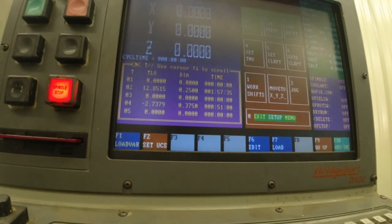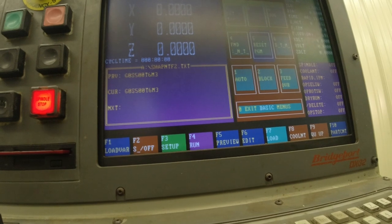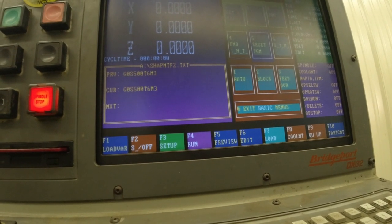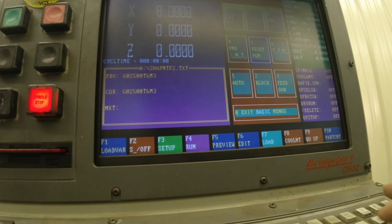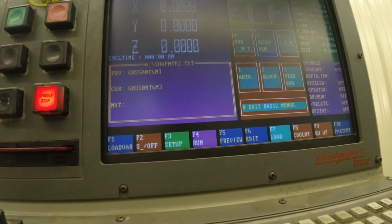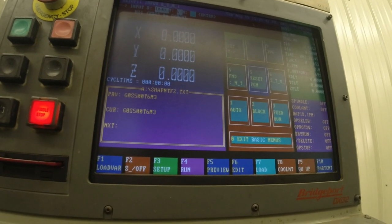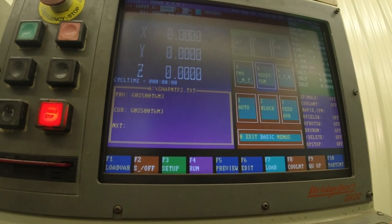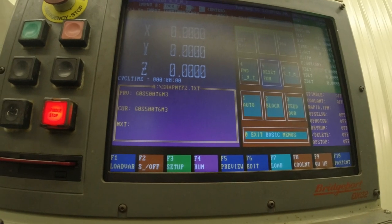The best way I found is to get out of this and go to the tool, and we're going to have it going at 500 RPMs again. Well, let's change that. Let's go to 1,000. We want tool number 6, then we want number 3 to go clockwise. Then we're going to hit plus. And that started the tool spinning.